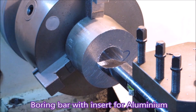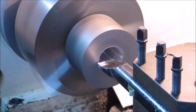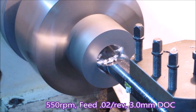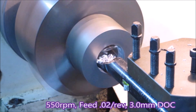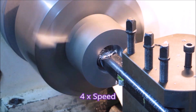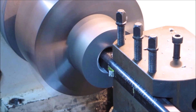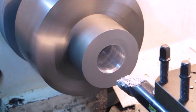There's a boring bar fitted to the block. That's a 3mm cut - when I was doing this regularly and feeling adventurous I used to take 5mm cuts. This is when I first found out that the rake on those aluminium inserts is so severe the part can actually be dragged forwards out of the chuck. Fortunately I was aware of this before anything actually flew out, but I did have things move forward on me. That's the amount of force generated by that 20 degree rake angle.